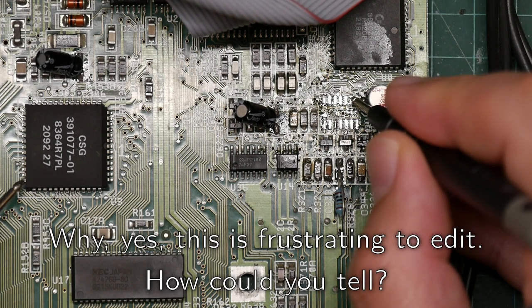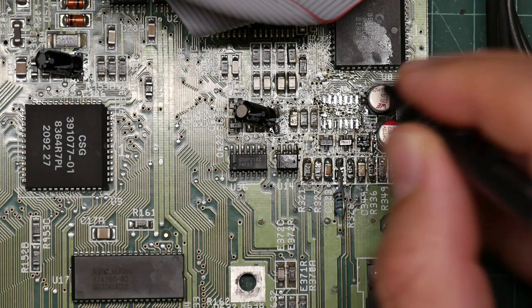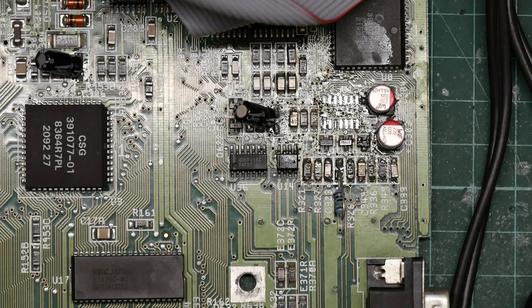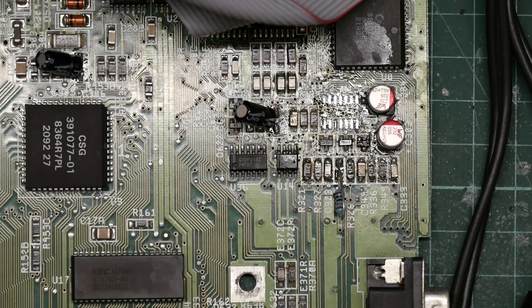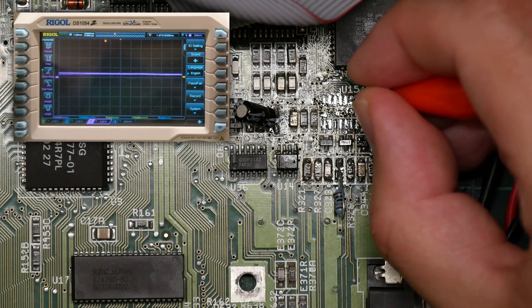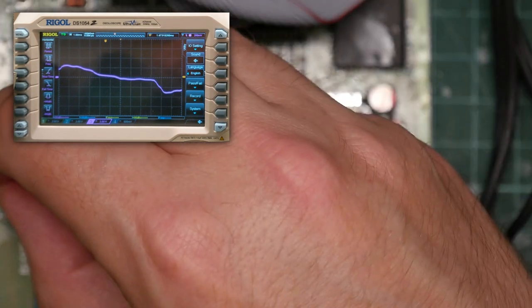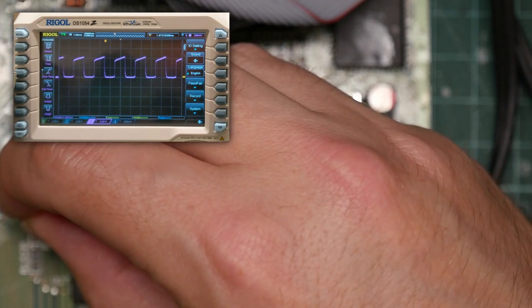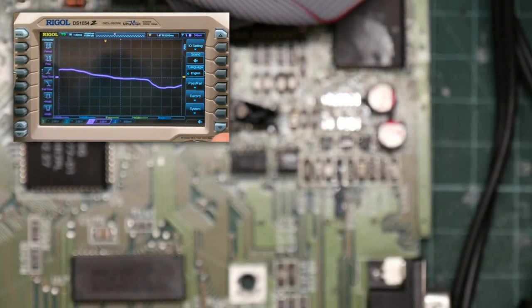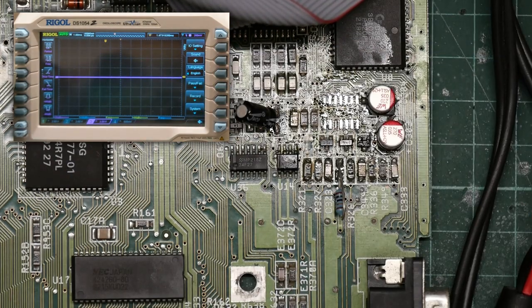Interesting. I'm sure I checked that pin, but let's power it up again and try that again. Okay, so this all sounds like a mistake due to me having the pinout here incorrect, but let's fire this up. So there's our input pin. Turn on the music. Set it to the sine wave. There. Okay, there is our signal. And there's the other channel. Oh boy, so it's not these two pins, it's these two pins. All right, well, you know what this means? It's time to put the op amp back on again.